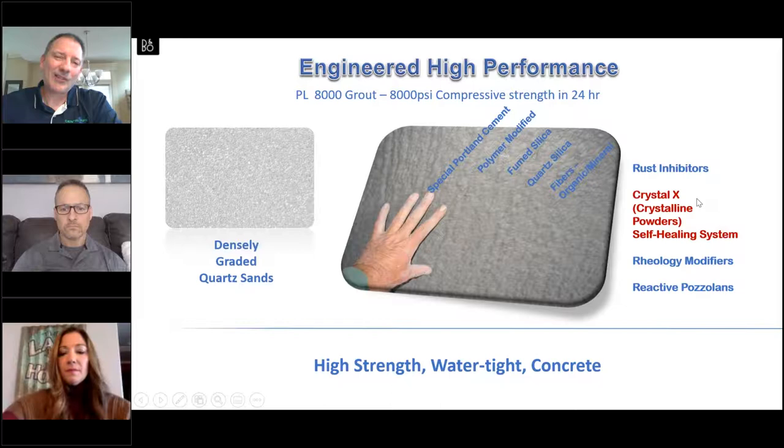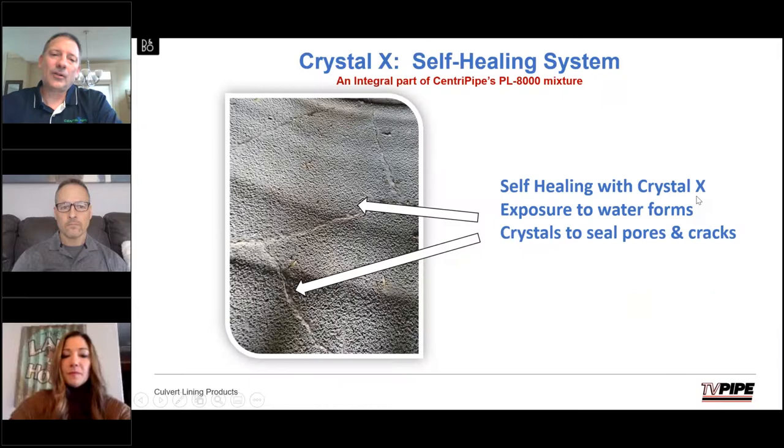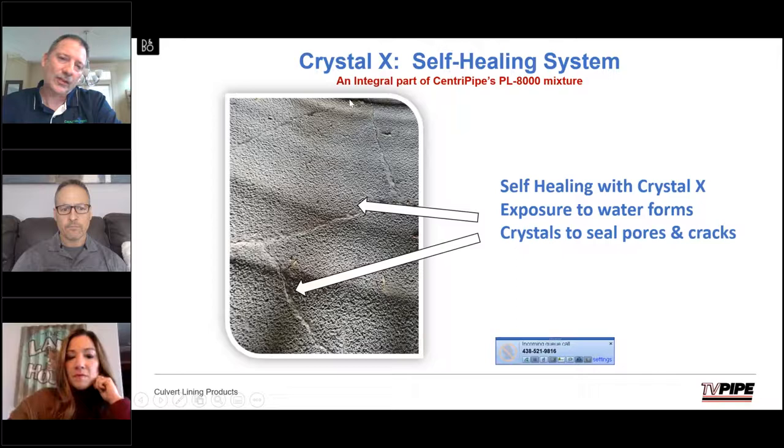The material also includes pozzolans and modifiers — cementitious but a hybrid like all the others. Here's the critical selling feature: concrete has cracked or it will crack, and that's where some clients and engineers get a little concerned. But we add our Crystal X self-healing component — as you can see, it's healing the cracks. It's rated at 0.625mm for soil tightness and 0.001mm for water tightness, so there will be no penetration. I just came back from a project where the customer saw cracks, we walked the pipe and explained it, and after the explanation they understood. That's an added feature benefit.